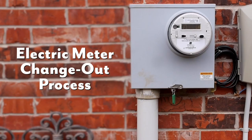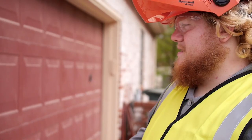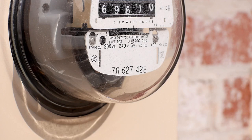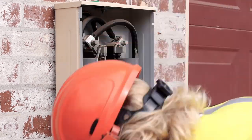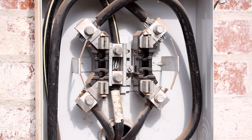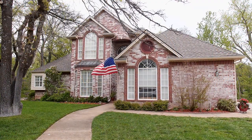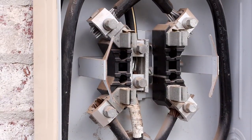Here is the electric meter changeout process. The meter installer will first take a photo of the overall site as found. Then the installer will verify that the meter number matches those in our records for that address. Once confirmed, the installer will record and take a picture of the current meter number before removing the existing meter. If there are any discrepancies, then that meter will not be changed out. Once removed, the installer will take a picture of the inside of the meter socket. If there are any hazards, UPA will immediately notify Edmund Electric and remain on site until an Edmund Electric representative arrives. Then the household will be made aware and provided the next steps, since any meters which pose a safety or fire hazard cannot be re-energized.